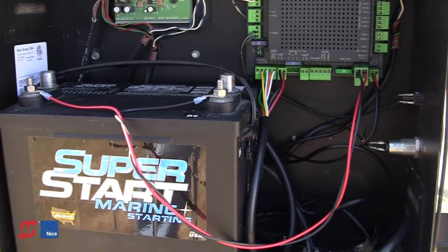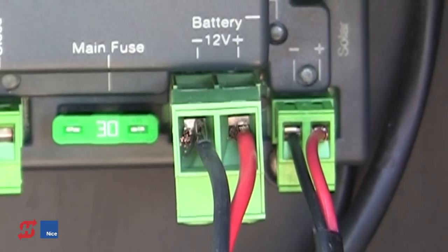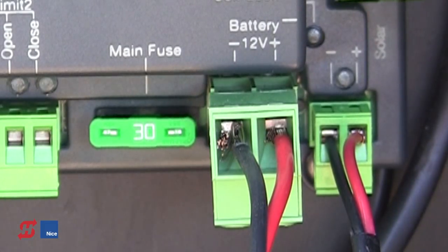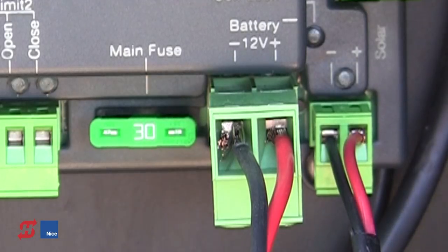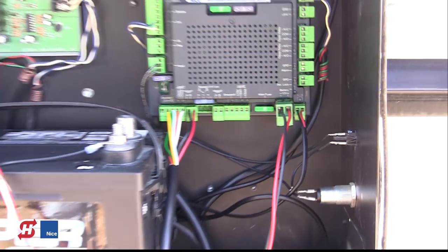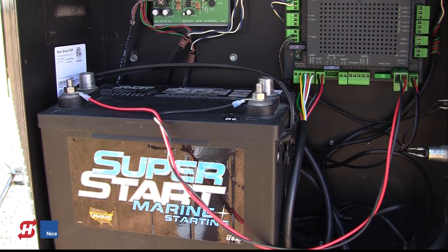In this case we're doing a solar application. Our battery connection is at the lower right area of the board — battery negative on the left, battery positive on the right. Just to the right of it are the wires from our solar panel, connected to the Solar P inputs on the board: black on the left, red on the right. We're using the internal charge regulation of the board to keep the battery charged. For an AC application, we'd use a fully automatic battery charger connected directly to the battery and plugged into an electrical outlet.